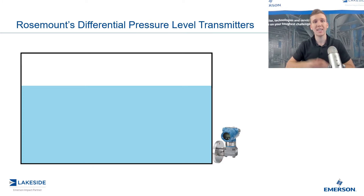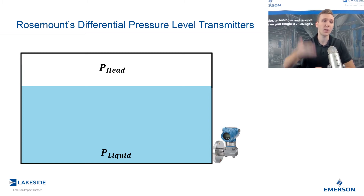So we take a look at this example. It's slightly different from the last video in the sense that the vessel is closed off to the atmosphere. So instead of calling it P atmosphere, we are calling it P head or head pressure. The differential pressure transmitter is going to sense the head pressure in addition to the liquid pressure. Just like with the atmospheric pressure, we want to eliminate this as we only care about what the level is in this vessel. The way it's set up right now, this DP transmitter's high side is exposed to the liquid and the head pressure, but the low side is just exposed to atmospheric pressure — and that's not going to give us a reliable and accurate reading. Instead, we need to expose this low side to that head pressure, because then we'll have opposite but equal forces, which will cancel each other out.